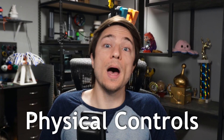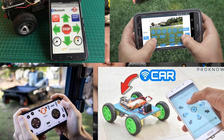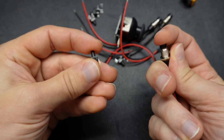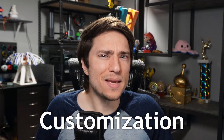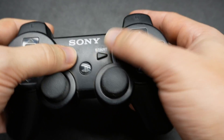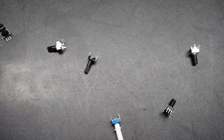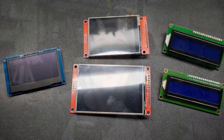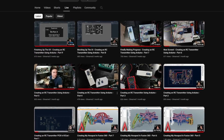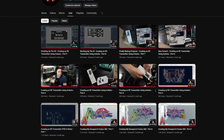It comes down to three main points. One, I want to have physical controls. The flexibility of a phone's touch screen is unparalleled, but I hate touch screen joysticks. Physical joysticks and buttons feel so much better to use. Two, I want to be able to add whatever I want. With a PS2 controller I'd be stuck with two joysticks, ten buttons, four bumpers, and a gyro. But what if I wanted to add potentiometers or a screen? I'd be out of luck. Three, making it from scratch gives me, and whoever else makes it, a much better understanding of how things work. Also, I decided to stream the entire process — check the description for links.